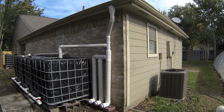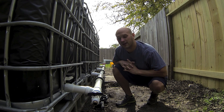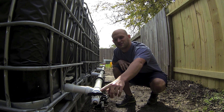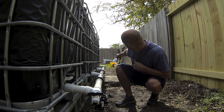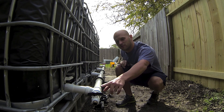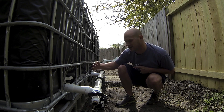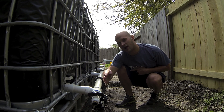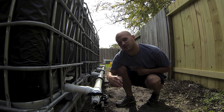Let's go down to the other end of the system. One thing I changed — I moved my water faucet connection here; it was on this end last time. I have my dump valve down there now, the big red handle, to empty my tanks if I ever need to. The reason for the move is that water comes in the first tank and flows down filling the tanks, and all my flow is directed this way. If the faucet were on the other end I'd be going against the natural flow, which would decrease my pressure.